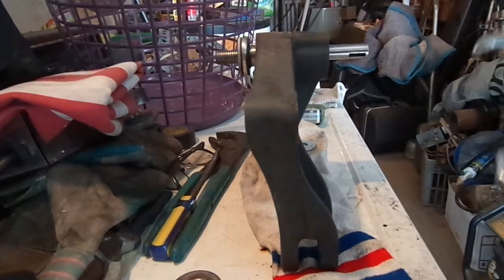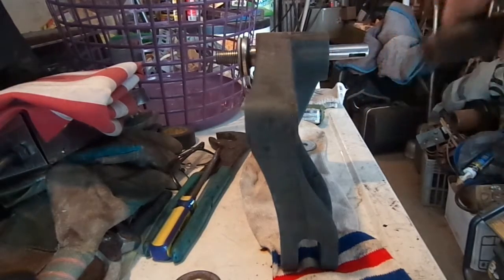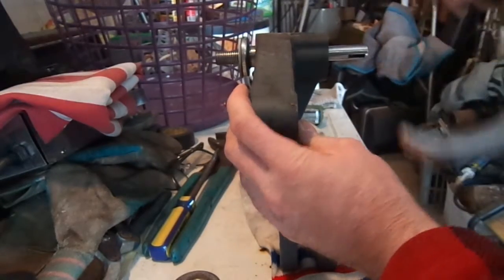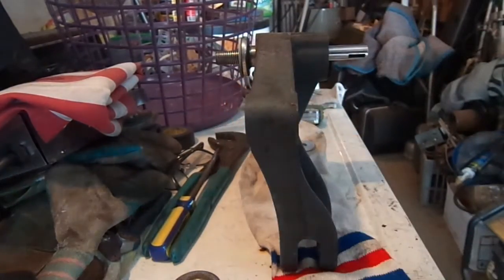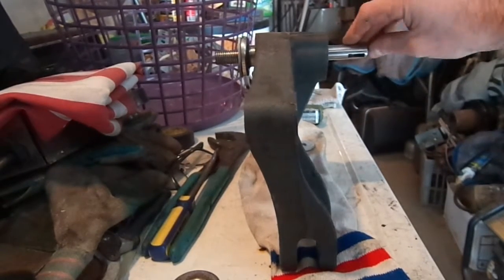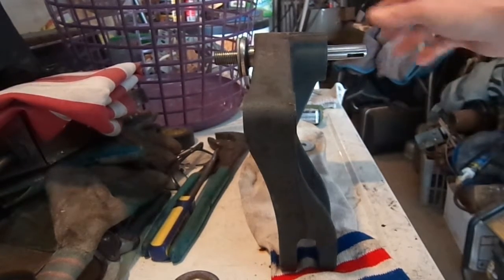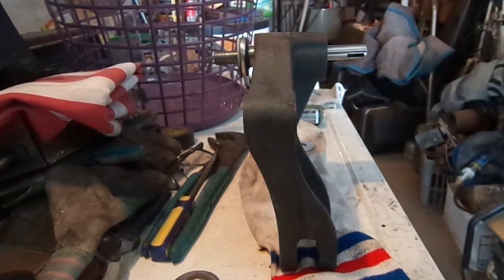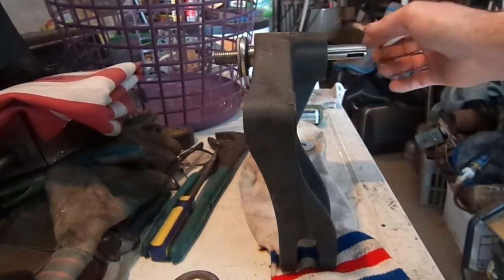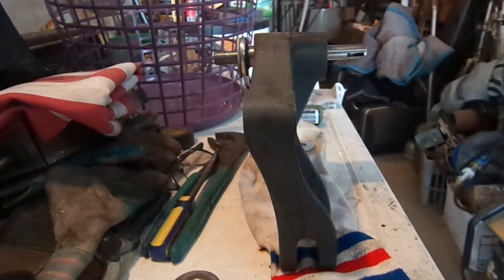And of course your stem here, right here, you can see the pin on the end that goes right up against the end of the shaft when you're doing it, and your 2 jaws obviously go over whatever you're pulling on there. I didn't actually make an indent on the end. When I pulled the bearings, the puller actually made its own indent, so it didn't slip off there. It's got a sharp enough point where it just drove a little divot in there for it to catch. But you may want to take your shaft and pre-drill a couple little divots on each end.